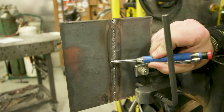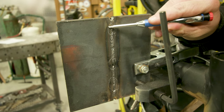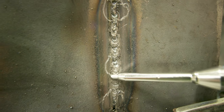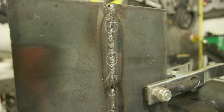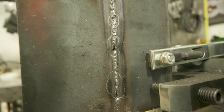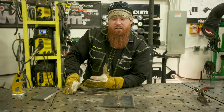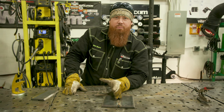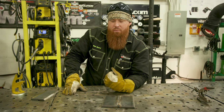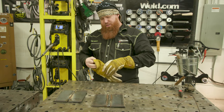We've got quite a few areas of incomplete joint penetration — exactly what we were trying to replicate. As you can see, the weld just wasn't able to punch through the material enough, basically because we squeezed it together too tight with that land. Now, if you're in the shop or on the field and things aren't textbook, you can turn your arc force up a little higher, increase your amperage, or put a little more pressure on the rod and still burn to the backside. It's about building good habits through repetition.